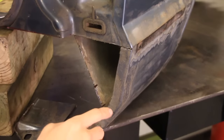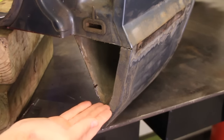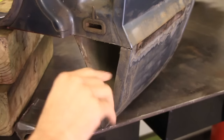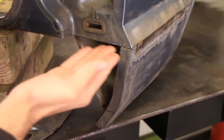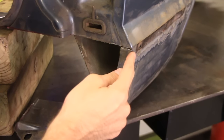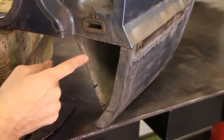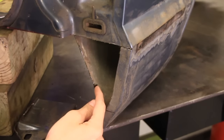The next thing we need to do is cut somewhere along down here and fold this piece up. This left piece is going to fold up to the right. This right piece is going to fold up to the left, making a flat spot along here. To do that, get a measuring tape and measure down from each side. On this side I want to go on the inside so I'm going to make it a little shorter — I've measured and marked four inches right here.